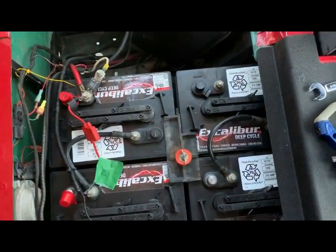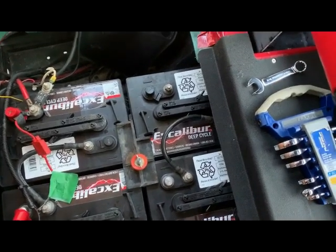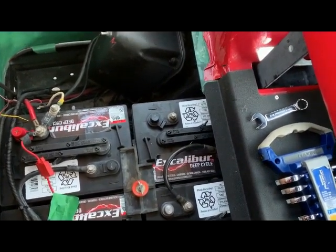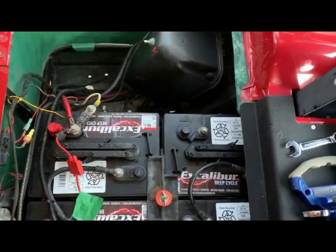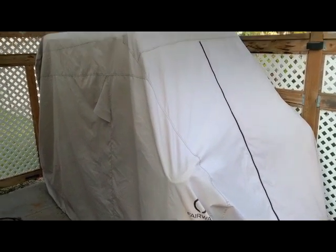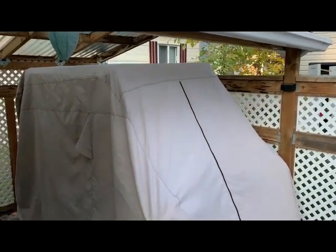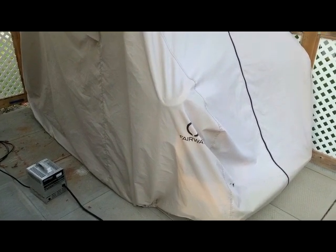This cart has been cleaned, double charged, and now I've disconnected that cable, so there'll be no parasitic draws through the wintertime. And with the batteries being supercharged as they are, the electrolyte won't freeze. Batteries are full — they won't burst and you're good to go. The cart is all covered up and in a fairly sheltered place for the winter. Ideally it would be closed on all sides, but we're at least keeping the snow off it. Batteries are disconnected, charged, and ready to weather the rest of the winter.